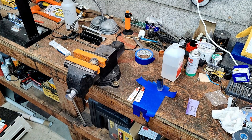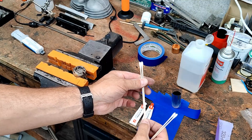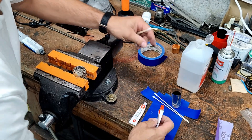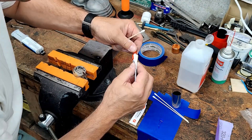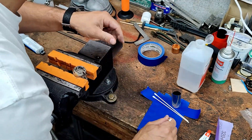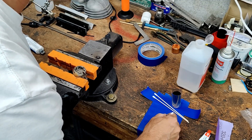Let me grab some stir sticks. What I use is wooden Q-tips — I use them in the shop for all kinds of purposes: cleaning carburetors, little nooks and crannies, and also as stir sticks. We have a cheap Harbor Freight clear epoxy. We're going to put a blob of A and a blob of B on here, roughly the same size, and then just mix it up. This says quick set epoxy — that doesn't mean it sets quick; it takes a while.